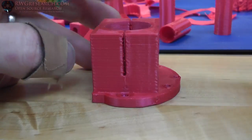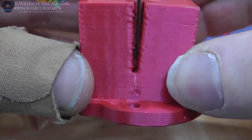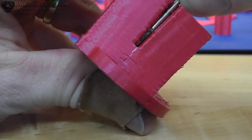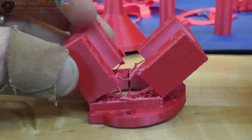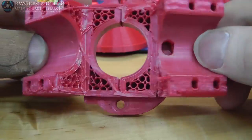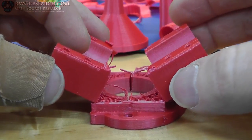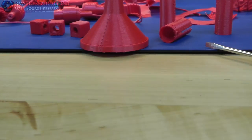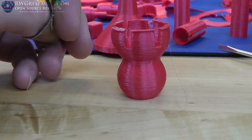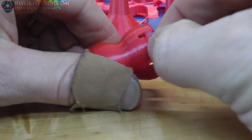So far my tests have shown that PLA plus will not crack like that, but you never know. Look at this piece — it gets pushed out, and what's happening is the plastic is stretching, not cracking. That took a lot of force to actually break, but as you can see layer adhesion is still my biggest problem. That stretching would go pretty far because of the little fibers in there, whereas on my 3D printer the ABS piece cracked completely apart — a serious issue. When printing a piece that's supposed to snap into the back of another one, my biggest issue was still layer adhesion.